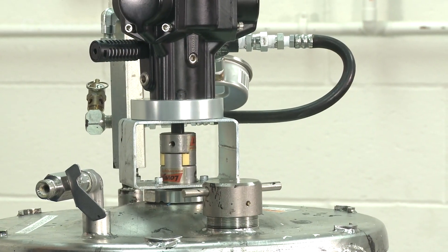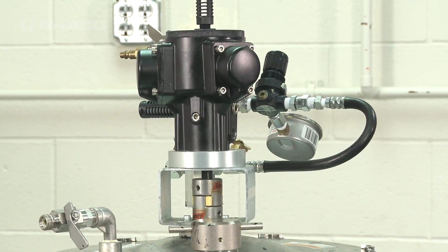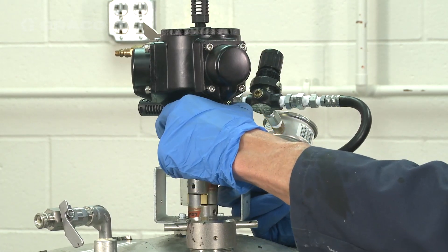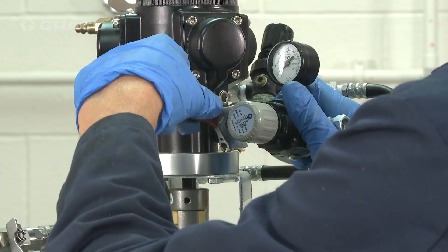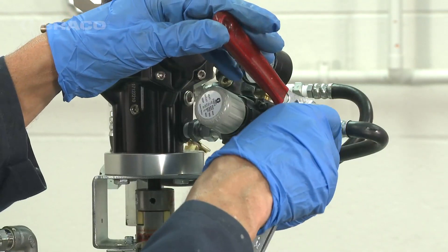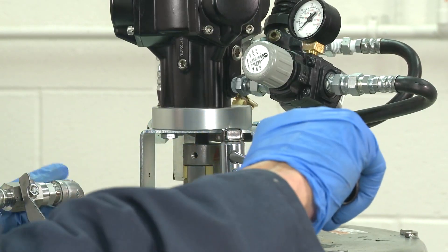Secure using medium strength thread sealer on the set screw. Leave about 15 thousandths inch gap between each of the coupling halves and the spider. Make sure the air inlet on the agitator motor is parallel to the air supply regulator, then secure the agitator motor to the bracket using the supplied bolts. Connect the airline and air regulator; tighten to 150 to 170 inch pounds.